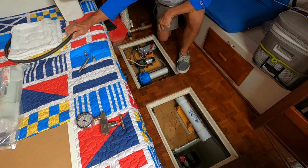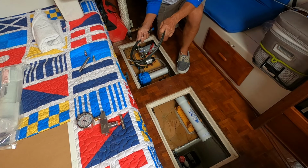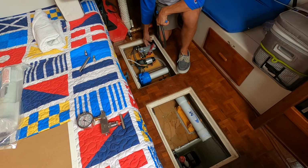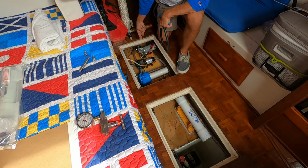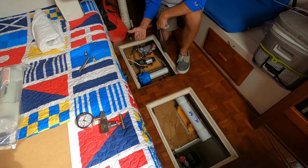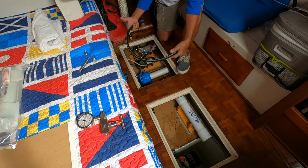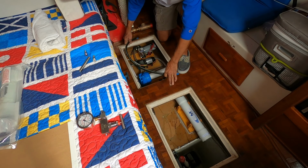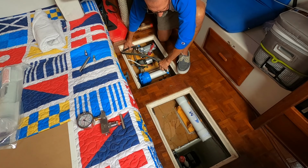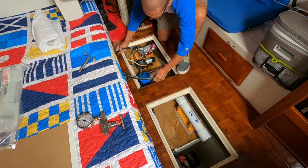From the pump, we're going to be going into this pulse dampening hose. And the reason you have this hose is because this is a piston pump. You've got a piston going back and forth, so it essentially pumps by spikes, okay? And that's not necessarily a good thing for your element. So we use this hose. It's recommended by Pump Tech. It's made to handle the pressure. So from here, we're going over to the pressure vessel itself. It's a straight shot right over to it.